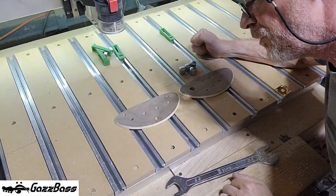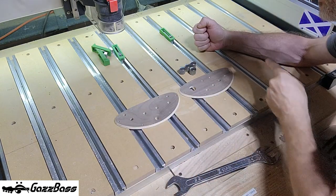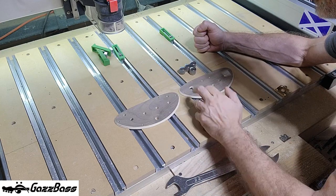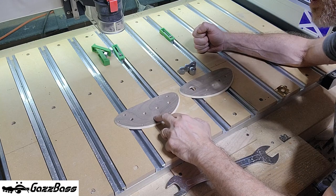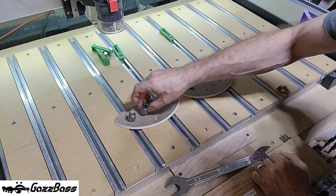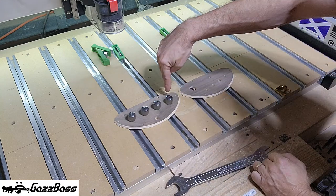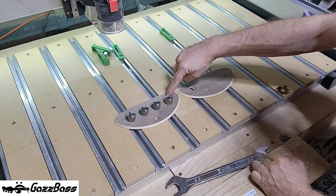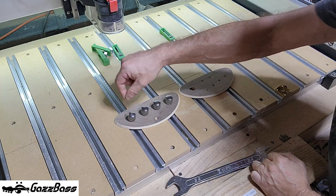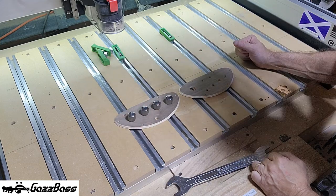All right, let's take a look at both plates that I just manufactured. One with a straight line there and one with a diagonal line there. You'll notice the hole here is much bigger, and I'll go into that in a minute, for the jack outlet. Jack outlet here and the jack outlet there. Now, here's how this would appear with the knobs on it. Fairly straightforward. And then a switch would be here for 9 to 18 volts and a three-way switch here to choose between series, split and parallel pickup configurations.